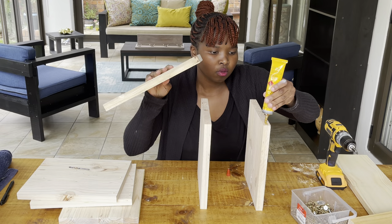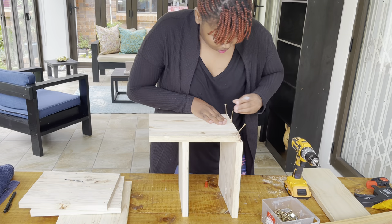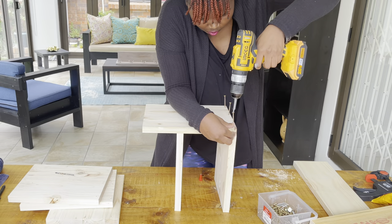For the structure of the wine rack we're going to need six different pieces which we're going to put together to form a V-shape. The two pieces that I'm joining have a difference of about 26 millimeters between them, so this helps ensure your V is in proper form. Because I've already pre-drilled my wood cut, the next step was just to put everything together. The screws I use are about 30 millimeter screws.